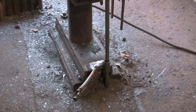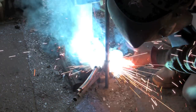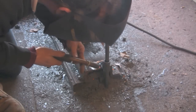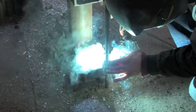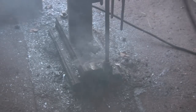Right, I've got it clamped up, lined it up where I want it, and I'm just going to tack it on. I didn't realize until I started welding this that it's actually a bit of galvanized — must have been a bit of galvanized channel that I used. So we've got plenty of fumes, and you don't want to be breathing in too many galvanized fumes because it's — I think it's cyanide or something very similar. Wherever it is, it's pretty nasty.